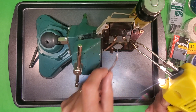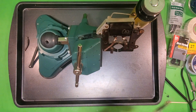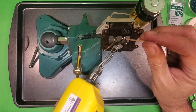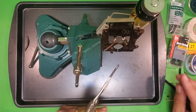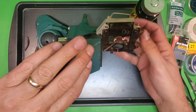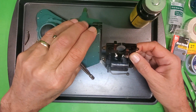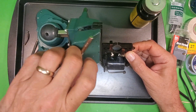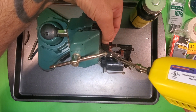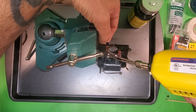What I'm doing right now is just heating up the old solder until it liquefies, and then the old wire will just slip right off. There should be a hole in the terminal, and I'm going to heat up the old solder to make sure I can get a hole in there for my new wire. I'm going to flip this around to do the other one because it was put in the opposite way. This is a hobby vise — you can get them at Harbor Freight or on eBay really cheap — and it's handy to hold things in place while you're working.